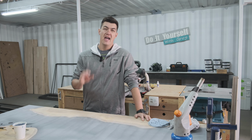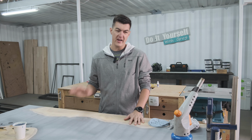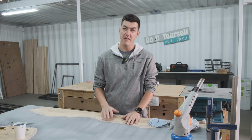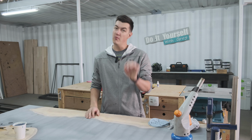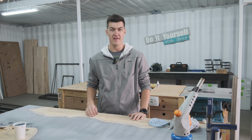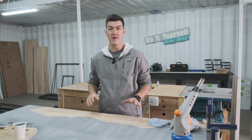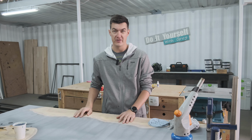So as you can see in front of me is a 6-seater epoxy table we are currently busy with. And the mistake I made was when I inserted my slabs into the mold, I applied wax release mold into my form, but I think I didn't apply enough wax in one section of my table. What does that mean? It means that when I removed my table from my mold, the white melamine stuck to the underside of my epoxy table.